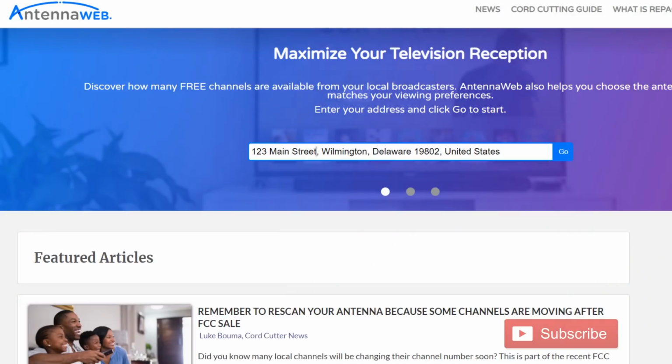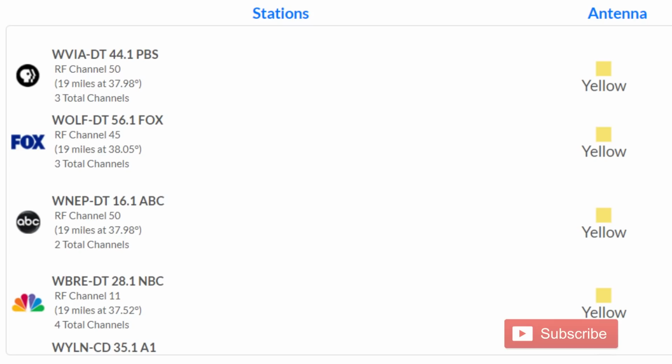Also note that most TV stations do not broadcast on the channel they identify as, so you might have an ABC 9 in your area that broadcasts on UHF channel 21, or you may be in the situation in my market where we have an NBC 28 that broadcasts on VHF channel 11. To find out what channels your local TV stations are broadcasting on, go to antennaweb.org, type in your address, and look for the RF channel number. The virtual channel is a channel that the station identifies as. So in my market, NBC 28 WBRE. But the RF channel is a channel that they broadcast on.